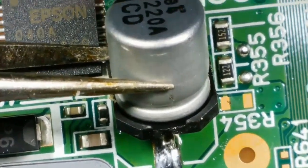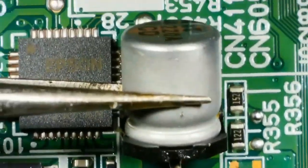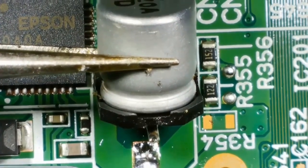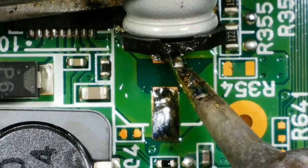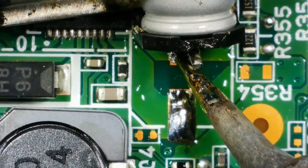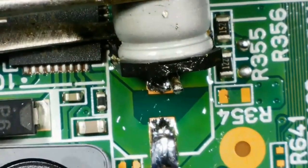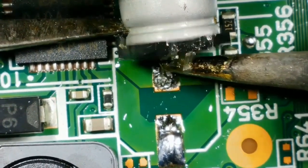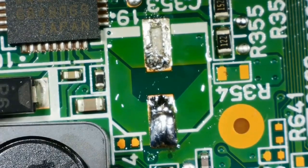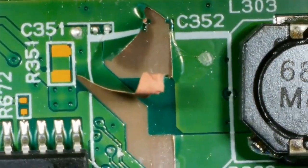Some people use two soldering irons, and some said you could grab the capacitor, twist clockwise, and it would come off. I tried that a couple of times but it ripped my board, so I'm scrapping some pieces from this board. Now that the first leg is up, instead of turning it around and working from another direction, I found it easiest to maintain this direction and use my soldering iron to work under the capacitor and release the other leg. I'm just heating up what's already there — no extra lead — and it just pops off as you slowly work. The black bottom base is just plastic, so any extreme heat is going to burn it. Technically you don't have to have it; it just helps create resistance from vibrating on the board.